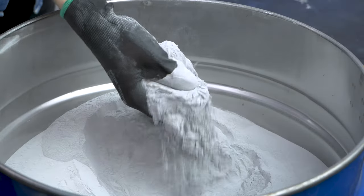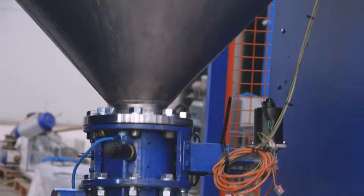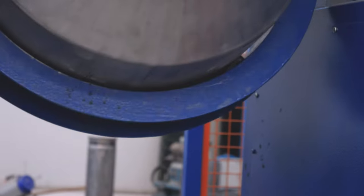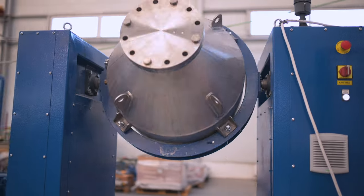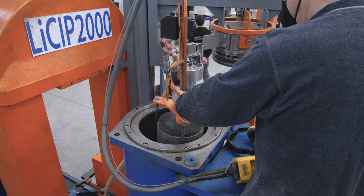The semi-product itself is made by the method of powder metallurgy. First, the aluminium powder is mixed with titanium hydride. The mixture is then poured into a polyurethane form and pressed at about 1000 bar in an isostatic press.